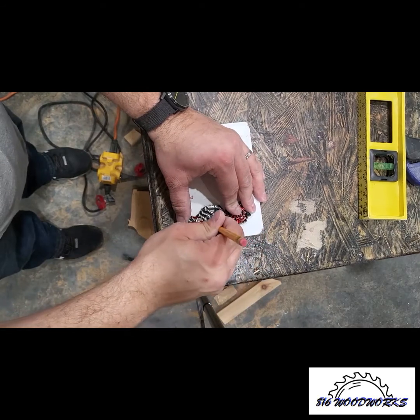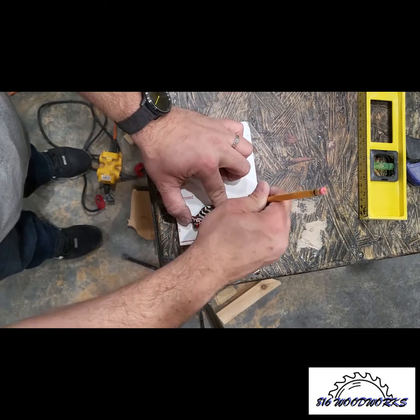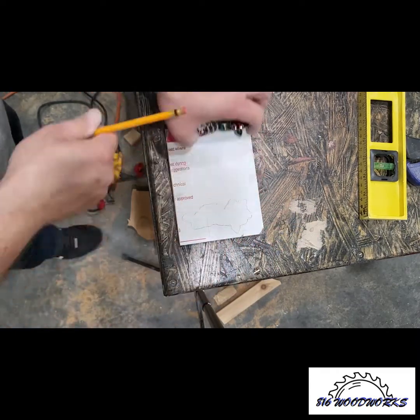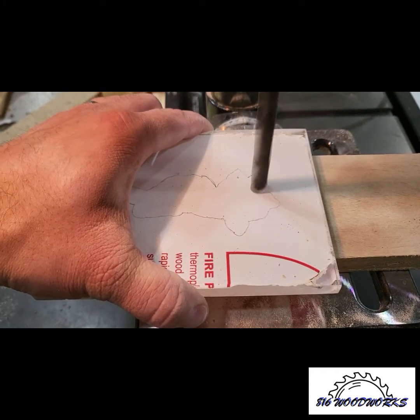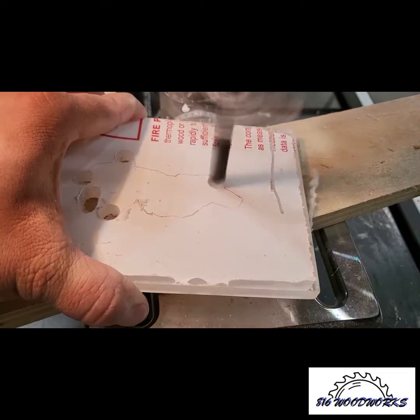The next step was to outline the coin for the plexiglass box and holder. I forgot to record the process I used to make the box and plexiglass display. In short, I cut out the shape of the coin from one piece of plexiglass using a drill press and jigsaw. I placed the coin inside the cutout and put a piece of plexiglass on each side to sandwich the coin in. I made a small wooden frame around the plexiglass to hold it together.